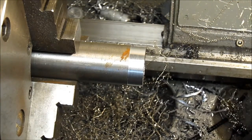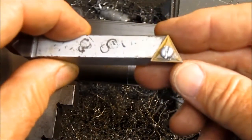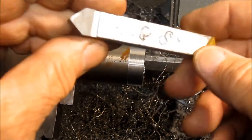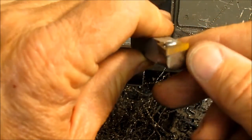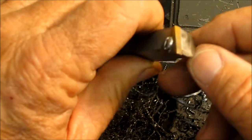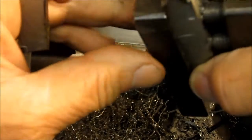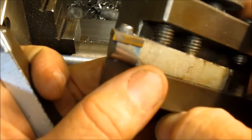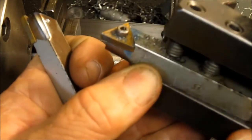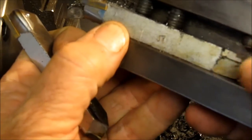Well, I'm real happy with the tool. Let me show you — I've got the camera set up. These are a couple of insert tools that I made previously before I bought these tool holders. You can see I just took a tooling bit — carbide on one side — and used the back side of it to cut the two angles, basically about 8 degrees in both directions for this insert. I actually did a left and a right, and those have worked out well for me too. So it's another cheap way to do it — the inserts were six bucks or something like that, and a couple of minutes in the mill to make the actual holders. Again, this was just on the end of another carbide tool.